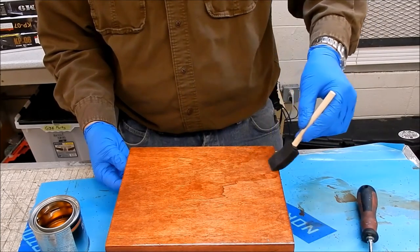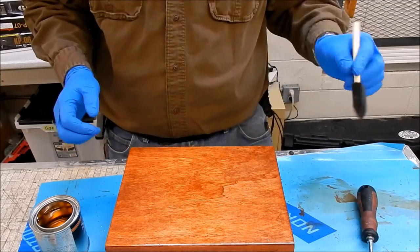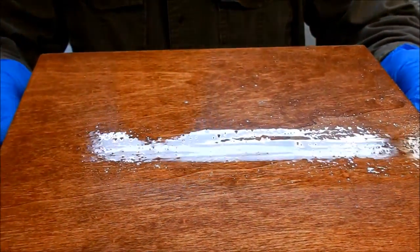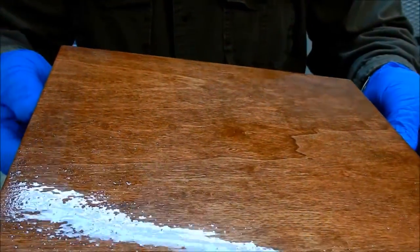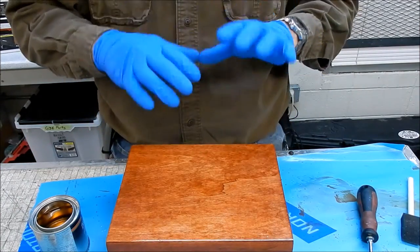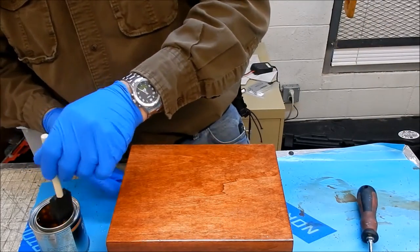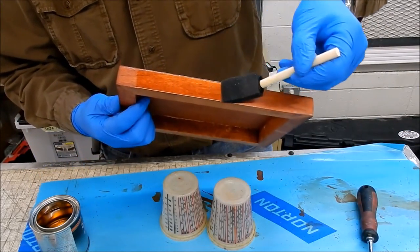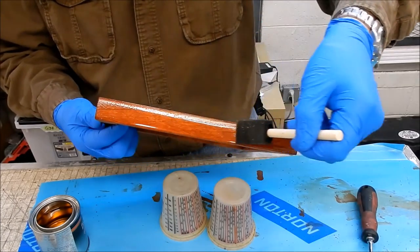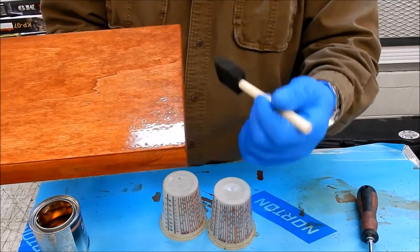Because it's an oil base it will take a little longer to cure up and dry out. When you do the sides, do one side and then the other. Don't go completely from one side to the other because it's vertical and some of it will pull down, giving you a kind of thick-looking run across the bottom. So don't be afraid to come back in 10 or 15 minutes and run the edge along the bottom to pick up any drips.